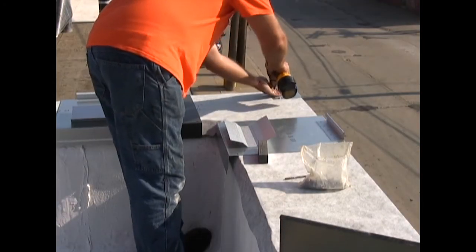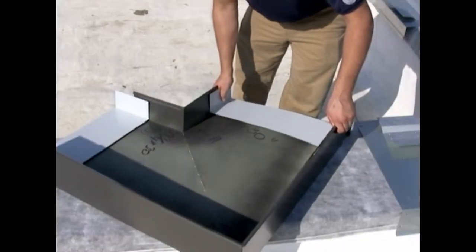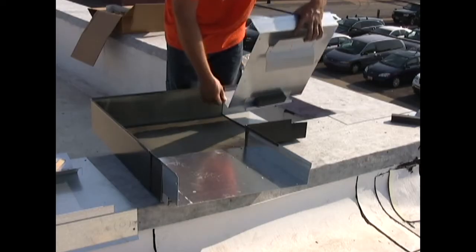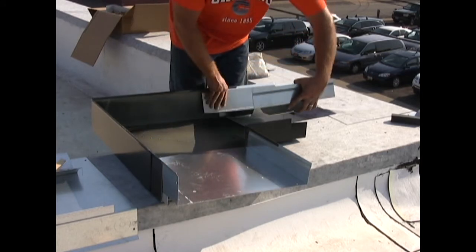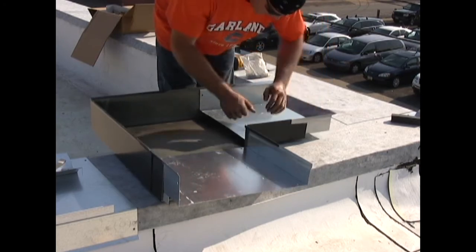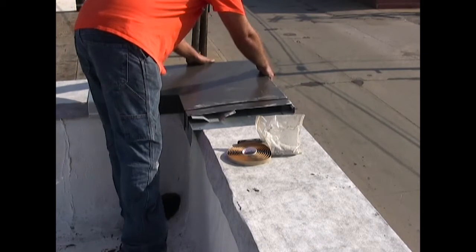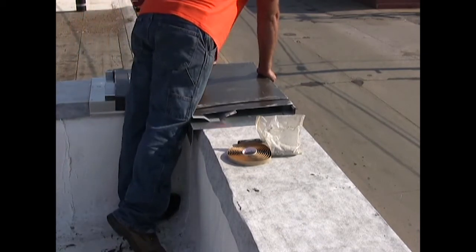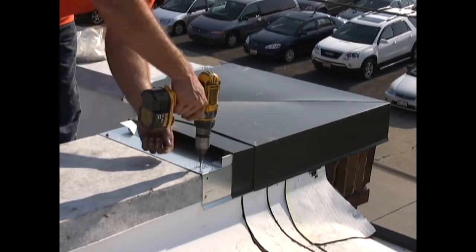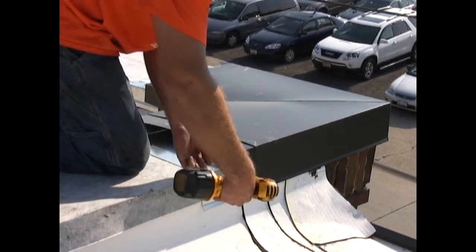Install the half-anchor plate on one side of the parapet for increased support. Position the splice plate so it is centered on each end of the welded corner. Install the anchor chair into the splice plate and welded corner miter — this is the complete corner assembly. Place the corner assembly into position and secure at the exposed edges of the anchor plates using the fasteners provided. Please note, large walls may require more than a half-anchor plate, or a custom anchor plate with modifications or custom springs.